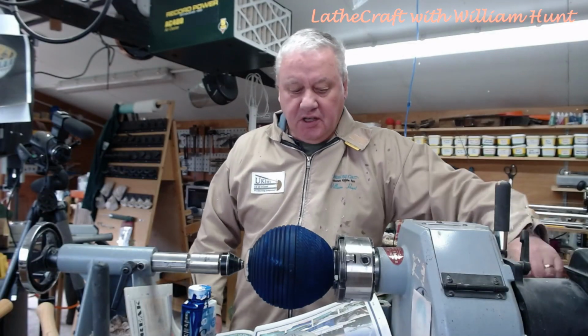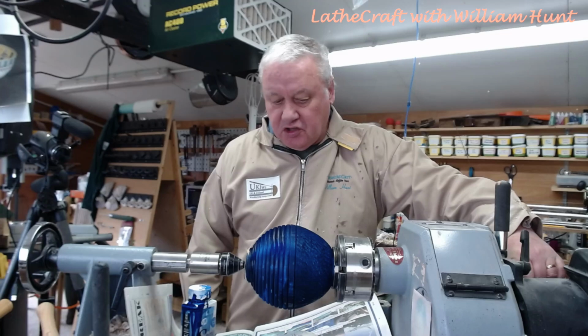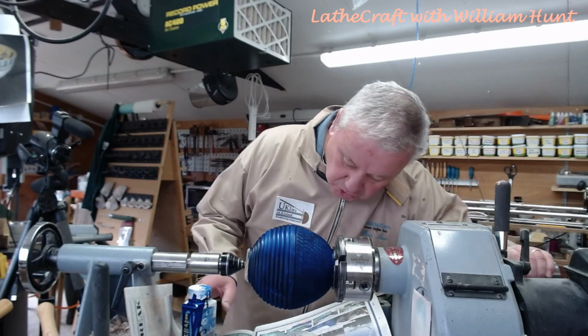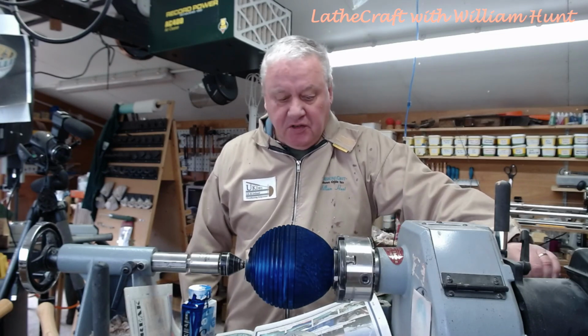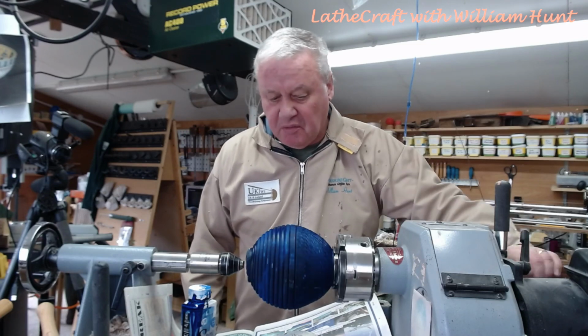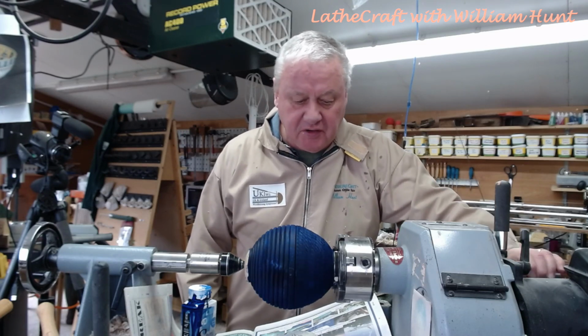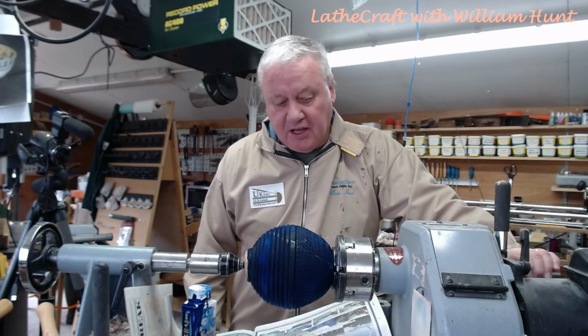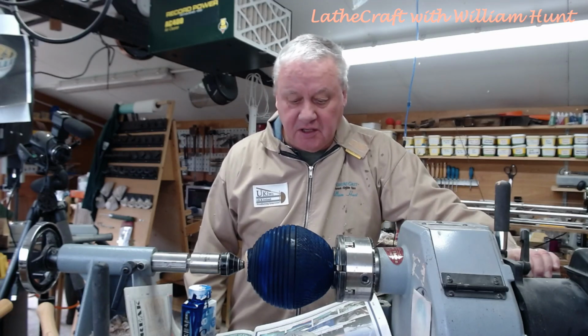Okay, that's the project then treated to a good dosing of Chestnut Royal Blue. Now I'm going to leave this to dry. I've never put spirit stain on wet wood before, so I'm not really sure what effect it's going to have, if any. I'm going to leave it for a little while, then I'm going to have to wrap it up in cling film and leave it overnight, because actually I've got other things to do. Yes, and then tomorrow I'll be looking at probably sanding it back, maybe adding a bit more colour, and then hollowing it out and finishing it.